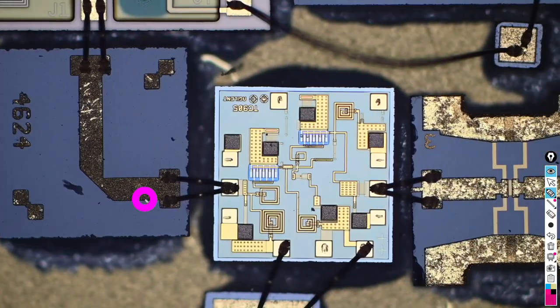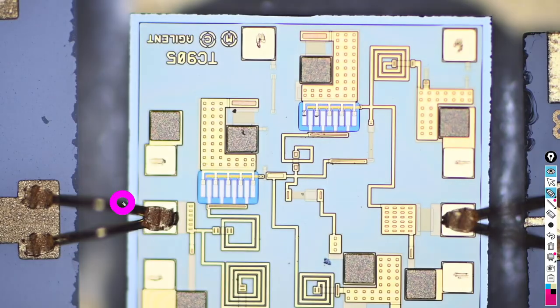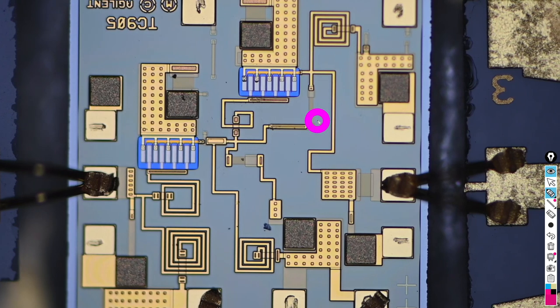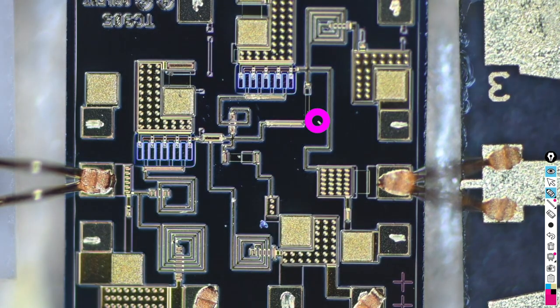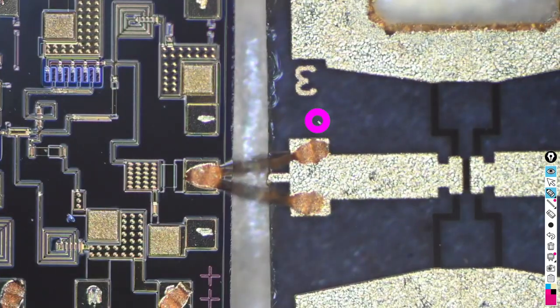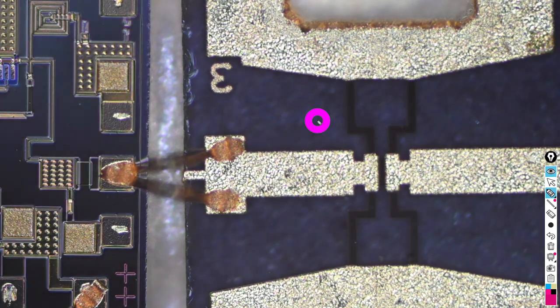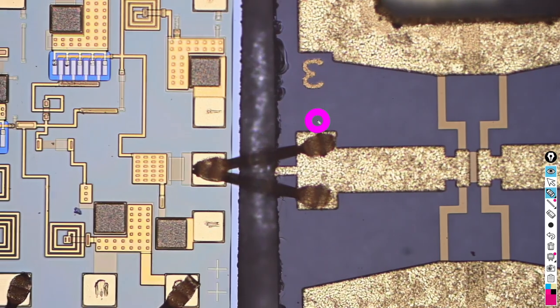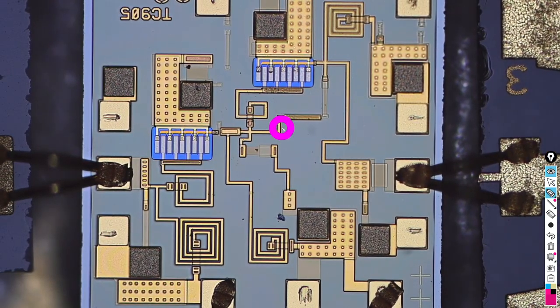I love these little devices. Looking closer at one of them — a beautiful blue color. This is an amplifier with two stages along with all the biasing. At some point I can sit down and actually draw out the schematic for one of these devices if you really want to. We can turn the DIC microscopy on so we can see some more interesting features. We can see surface roughness, the different layers and materials a little bit better, and how the gold surface of these components has this crystalline structure on top. Really beautiful stuff. I think we understand the architecture of this fairly well, which is not surprising since we already knew what to expect, and now we can see it in action.